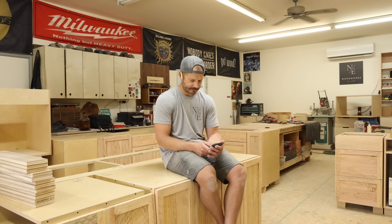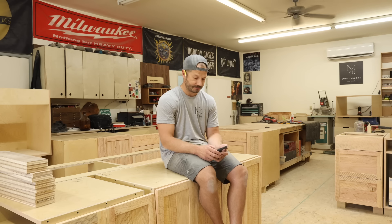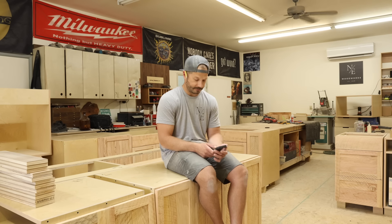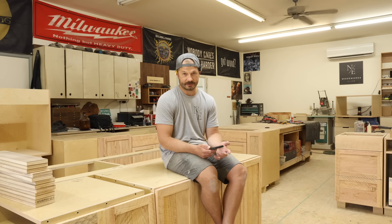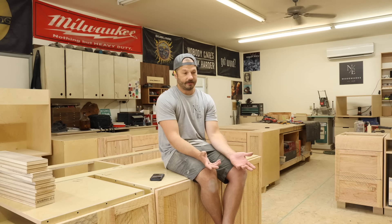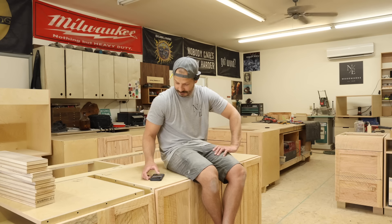How did you start your own business? I covered this in another video, but basically I was working at a shop, started building my own small shop at home and taking on side work, and it just grew and grew to the point where I couldn't do both anymore, so I quit my job and went off on my own. Do you measure your hinge plates or just shim the door? I don't measure — I lay the cabinet on its back, use a quarter-inch shim, put the door on edge, and screw the hinges in. That gives me an eighth-inch offset off the cabinet. Only works on overlay though, not inset.